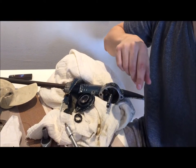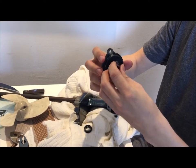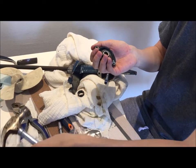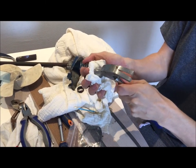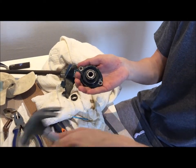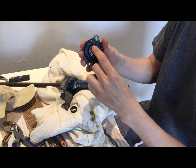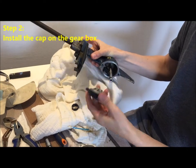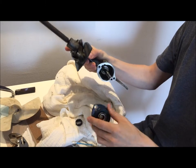At the end you just clean it inside — it looks like that — and you're ready for the replacement with a new one. You just insert the new seal inside, put pressure on it, and you can gently use the hammer with protection. Be careful, because if you go too hard you risk bending the little metal part.